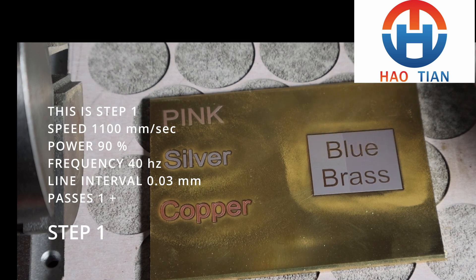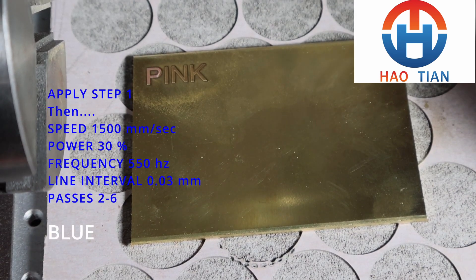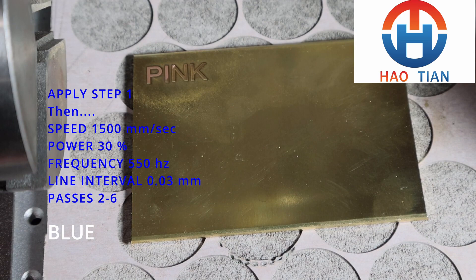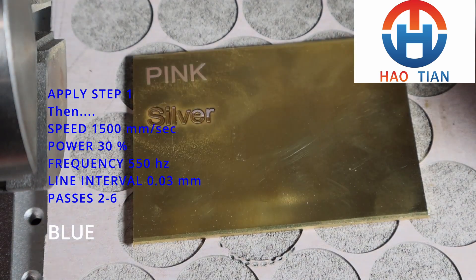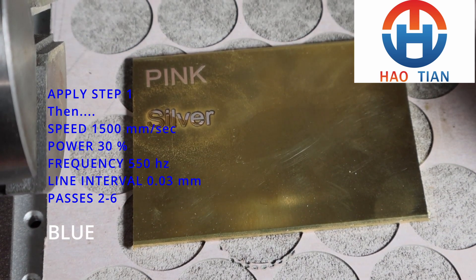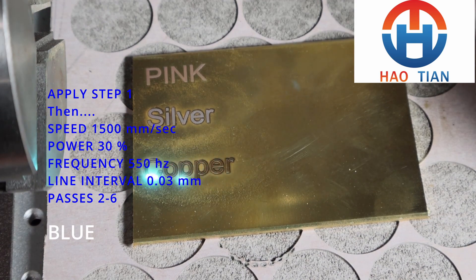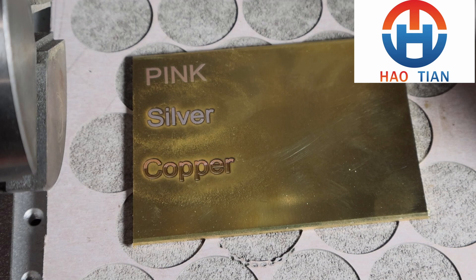All the colors I'm sharing today — just do that before you do them. For me and my work, the metallic colors are by far the best: the ones that look like copper, silver, bronze. They give spectacular results. However, I have found that if you do more passes the colors will change — you'll see the next pass come through and the color changes, all in real time. I found some colors will only come out running slow, so do your own tests and find the best colors for you. Put your results in the comments — I'll definitely collate them for the laser community. If you find cool colors, please share them with me. You can contact me through my website at NirocTools, www.niroc.com.au.